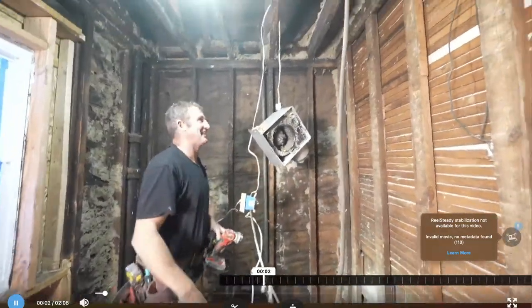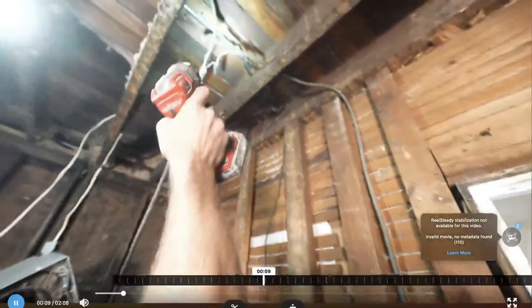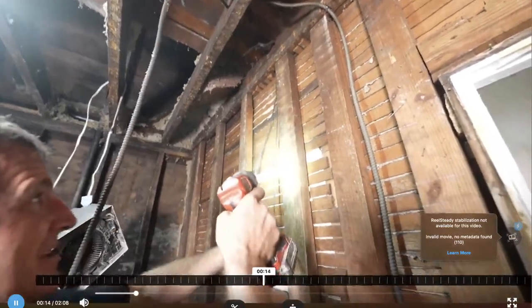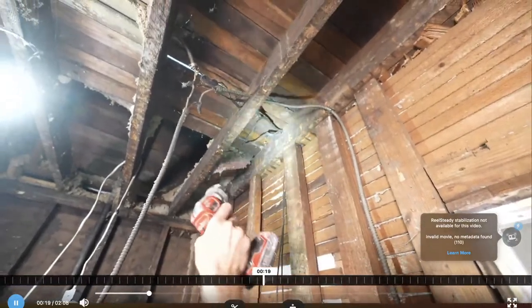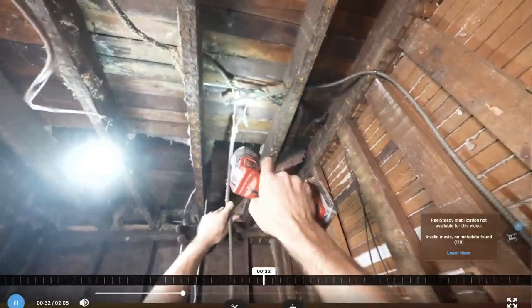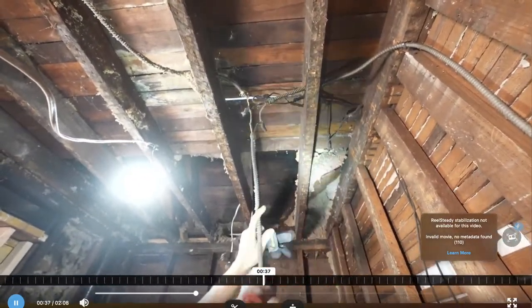The electrical is a mess. My vent fan and all this existing wiring is connected to old knob and tube wiring. You can tell by the separate wires covered in cloth — that's all knob and tube. This is all dead because I removed it from the rest of the house, so now we just have to remove this old BX cable and disconnect everything. It's a bad sign when you see all that connected like that.